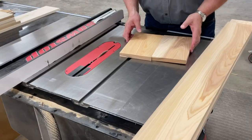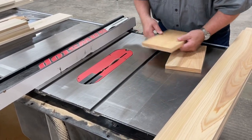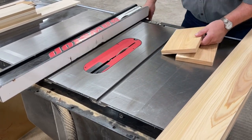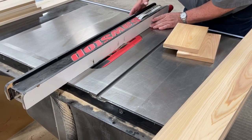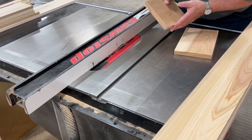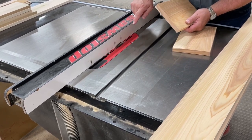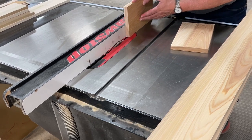and we're going to do our table saw raised panel door. We're now getting ready to cut our groove for our panels, and we've set the saw at 3/8 of an inch high. We're going to set our fence at 1/4 of an inch, because that's going to be the space on the back side of our panel. I've removed the riving knife. Typically we would leave a riving knife in, but this riving knife on this particular saw blade is too high for a channel cut like we're going to do.